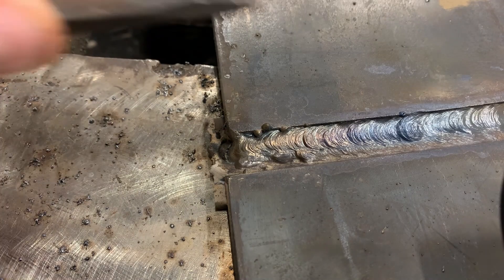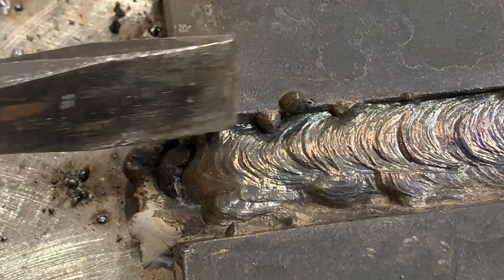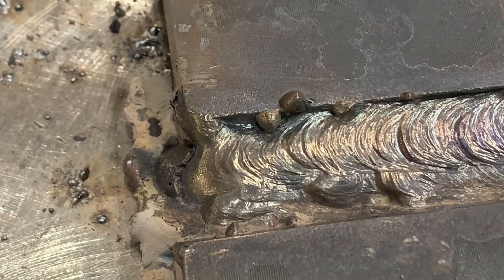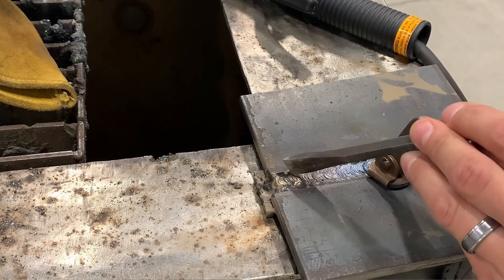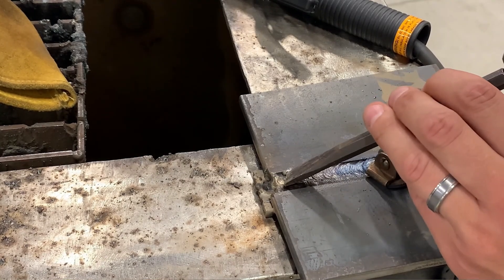Here's a good example where there's some spatter left over. If you were to weld over it, slag will stay trapped — there's a lack of fusion into the side wall — and that will show up as a pocket when you do a destructive test. This is why it's very important to remove any spatter and get rid of any slag. Once I hit it with the chisel, I come in with my pick — something sharp — and remove any leftover debris.